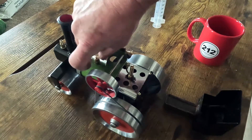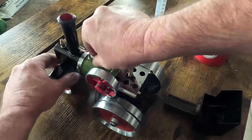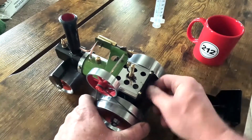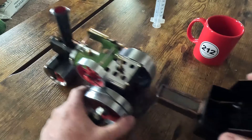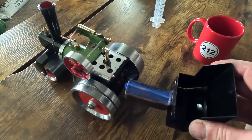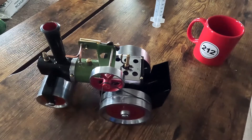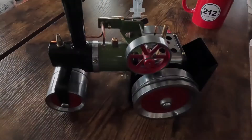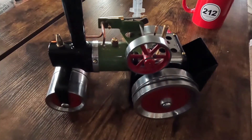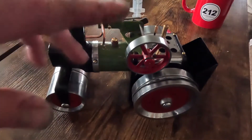You can see the flame burning blue, and we install this into the bottom of our fire box, then we'll wait to raise some steam. Another thing about these early first models is there's no forward and reverse on here, there's no throttle — these are forward-only running engines.